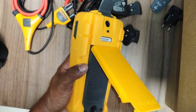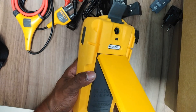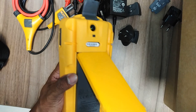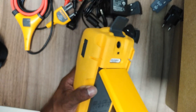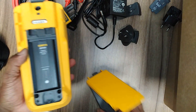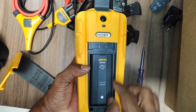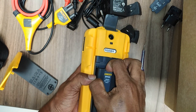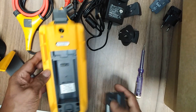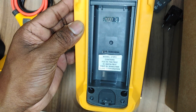Disconnect the battery charger and move the product to a non-flammable location if the rechargeable battery becomes hot — above 50 degrees Celsius — during the charging period. Also importantly, replace the rechargeable battery after five years of moderate use or two years of heavy use. Moderate use means recharging twice a week.